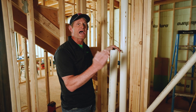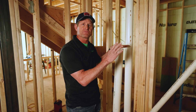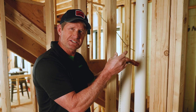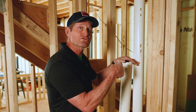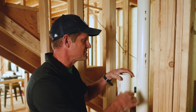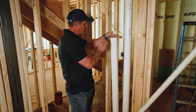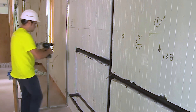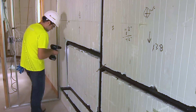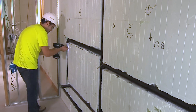Sometimes you're going to have to strap a pipe into place, and with an insulated concrete form wall, that couldn't be easier. Because remember, every eight inches vertically you have a polypropylene strip that is an inch and a half wide — like a stud, if you will — that you can easily install a screw into. So if you're going to have to strap a pipe to a wall, it's easy. If the pipe wouldn't fit in the ICF, we'd have a little fur-out there, and then to secure it, we would pull plumbers strapping across that and screw it into the web on either side of the ICF — just like in typical construction, securing it with a commonly used material like plumbers tape.